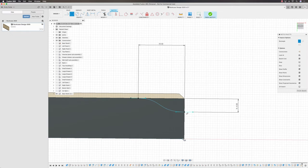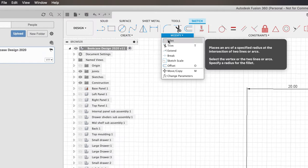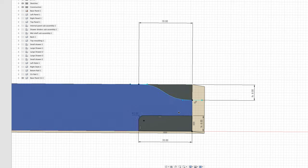Now let's do the back cut — make that joinery, and the bottom dimension also 20mm. I don't want this corner to be quite that sharp, so I'll round it off using the Fillet tool under Modify in the sketch. It places an arc of a specified radius at the intersection of two lines. Click that line and that line — it gives 1mm. Selecting the arrow to adjust: 2mm looks about what a router bit would give. We've now got our profile there and our back cut profile.